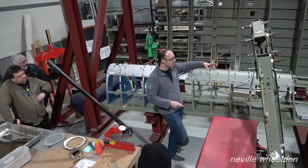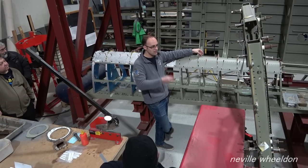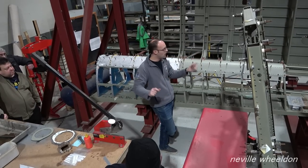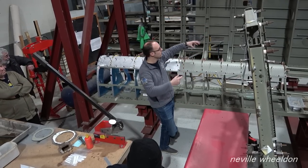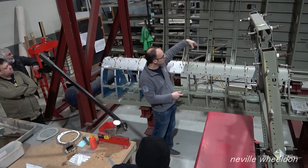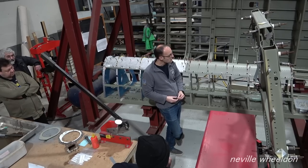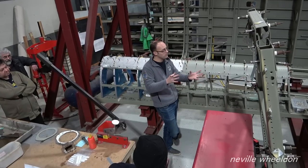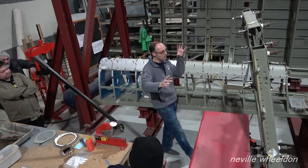Each rib was also built as a separate assembly. In the factories building parts for Lancasters, somebody would be sat at a bench producing, say, rib number 28 day in, day out — in a separate little jig — bringing together extruded parts, skins trimmed to fit, riveted together, put in a box. The box was then taken to the assembly plant where all the ribs were put into the spar section — produced on another jig elsewhere — all brought together, stringers put in place, and then somebody just firing skins on all day. Very much like the production line Ford introduced with cars: small assemblies brought together as one major assembly.